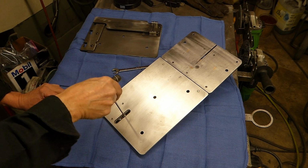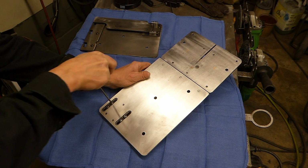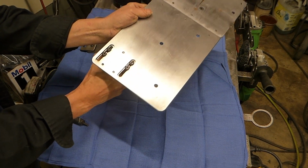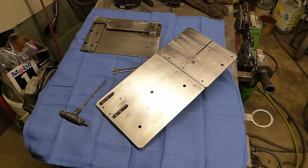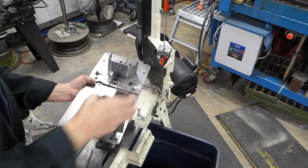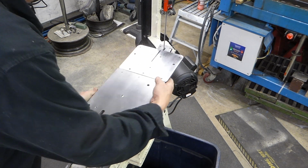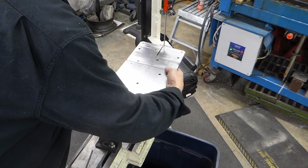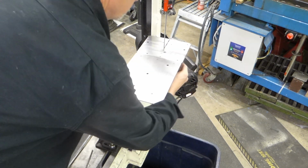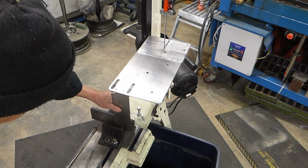To adjust the leg, loosen the adjustment screws slightly and place the leg in the vise as you mount the extension, or the table extension pair, to the saw. Position the adjuster so that the leg is plumb to the saw's top surface. Tighten the screws.